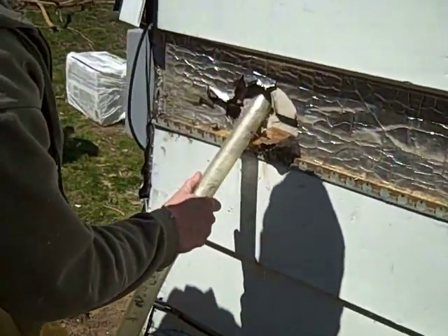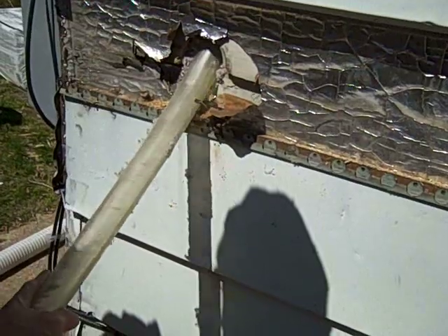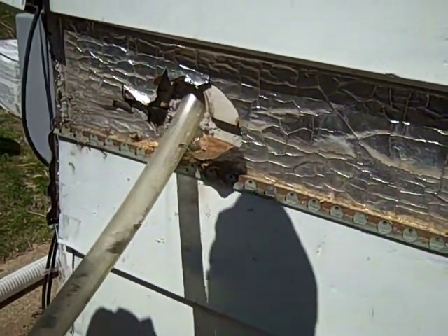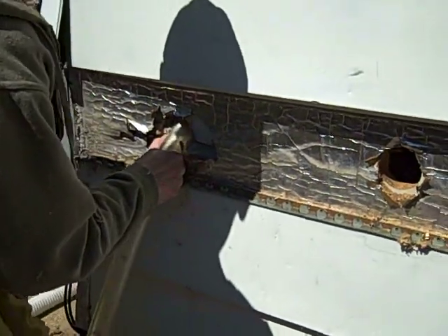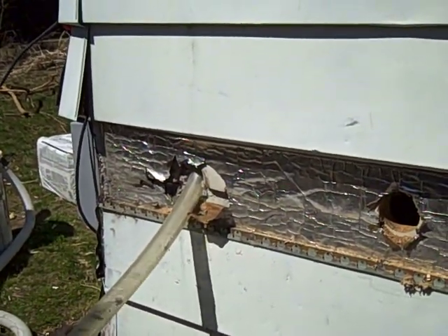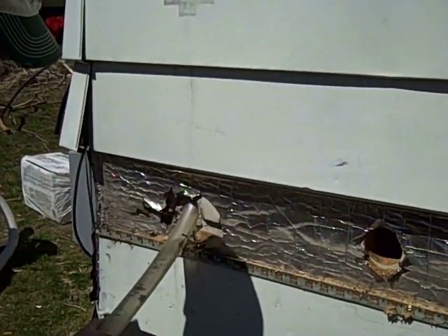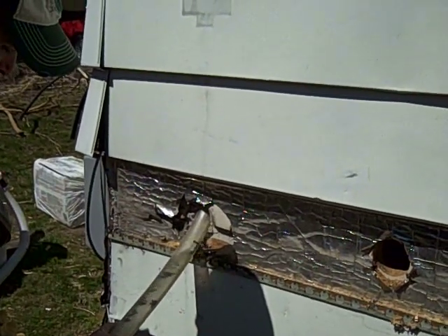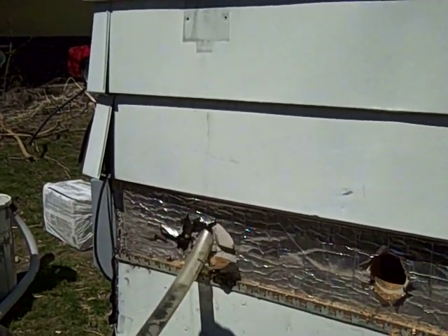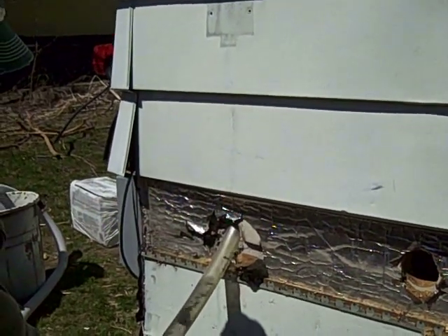You can see the fill going through the tube — it creates a lot of static charge, so you are going to be getting shocked. It is going to take a while for this to pack because we have an open cavity going all the way up and the force of our blower is pretty high. We expect that maybe 2-3 feet above the end of the tube is going to get packed.